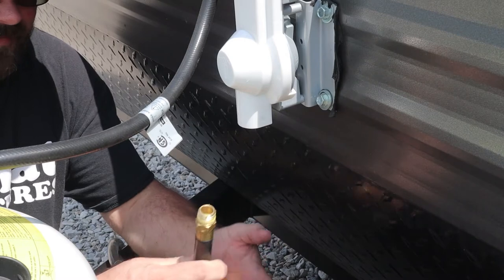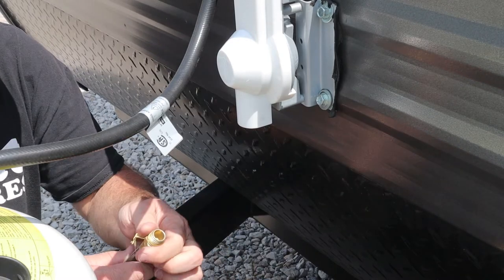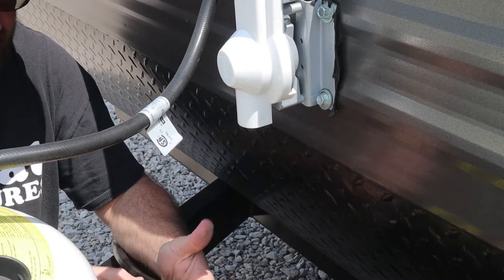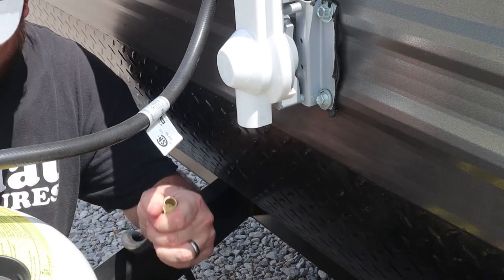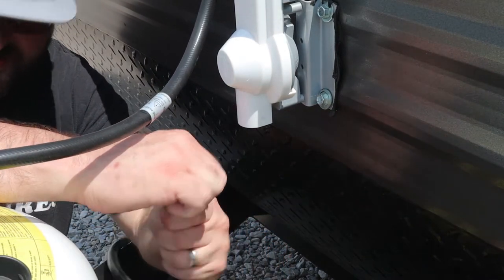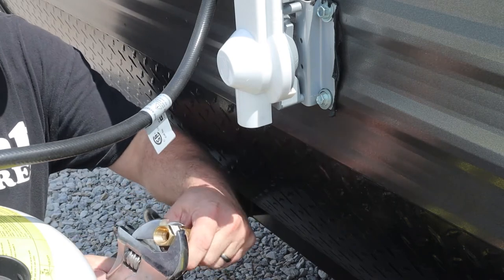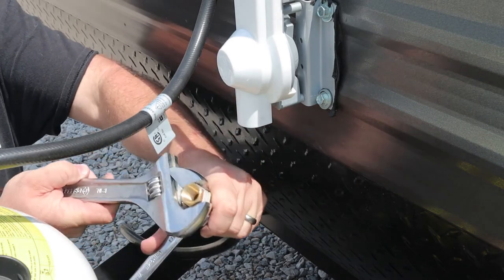Here's the end of the hose that goes to the regulator. The first thing I want to do is install this coupler, 3/8 to 3/8. I like to just put one layer of gas tape — this is similar to plumber's tape, but just one layer of gas tape on here. Get a clean one, just one layer. You don't want it bundling up when you start screwing this stuff in. Now we're going to put our coupler on here. I'm going to screw this in nice and snug. I've got an 18-millimeter wrench here, and then I'm going to use a crescent wrench for the top piece to get it nice and snug. It doesn't have to be crazy tight, just snug.